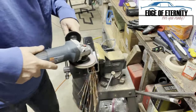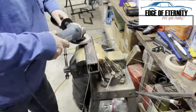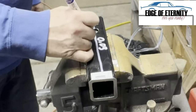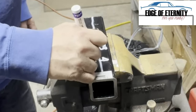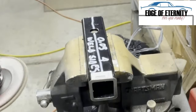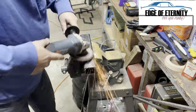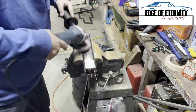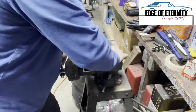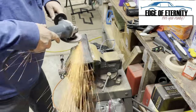The first task is cleaning off the old paint — or I should say the brand new paint — off of the hitch itself. Now I've removed the hitch ball and I'm going to use that as a dolly block at some point. I'm going to put approximately 30 thousandths thick weld, probably closer to 50 or 60, then throw it on my Bridgeport and all four sides will have the same amount of weld. I will machine those down to about 25 or 30 thousandths thick and that will give me a nice loose slip fit between the hitch portion and the hitch receiver. Those are going to make up my lower die holder for the English wheel.